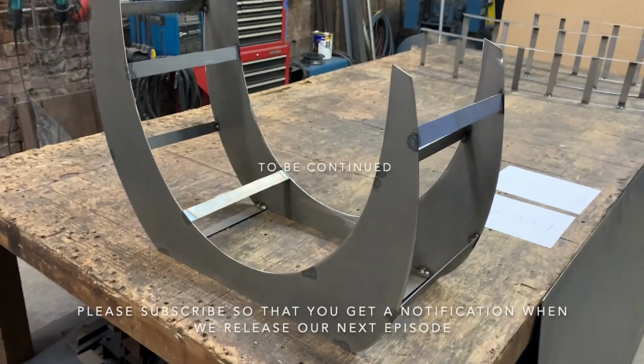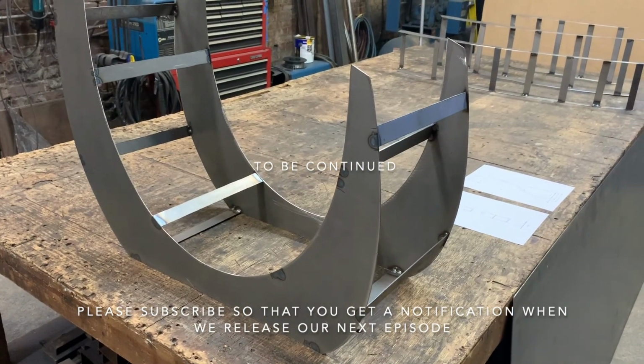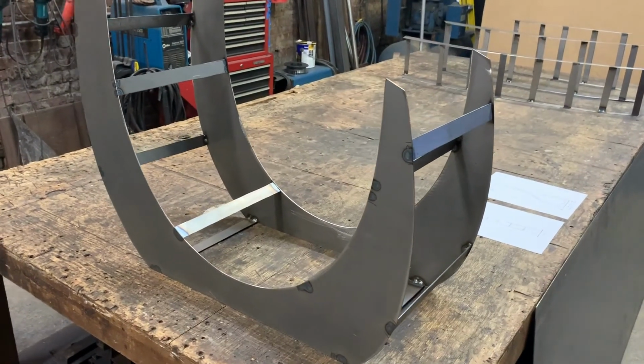When cutting the metal pieces for a curved area, make sure that you make them much longer than they need to be so that you have some leverage to roll them into shape.